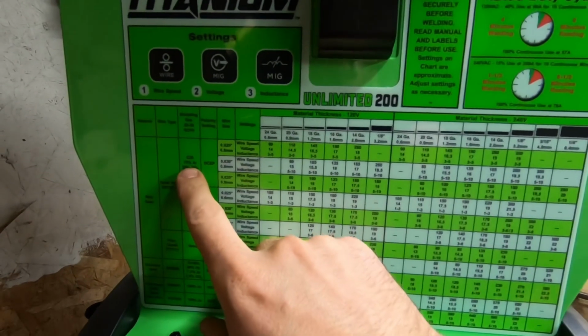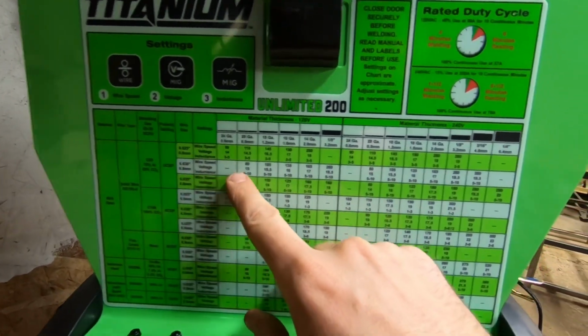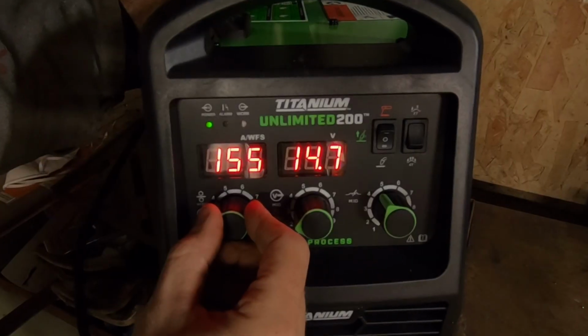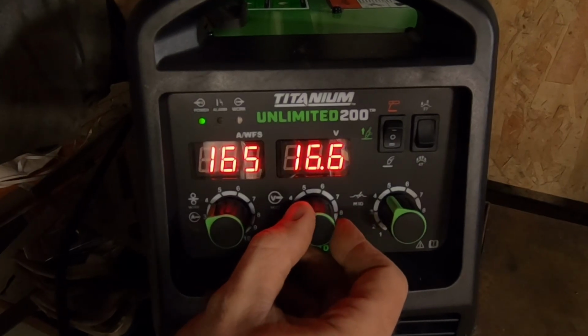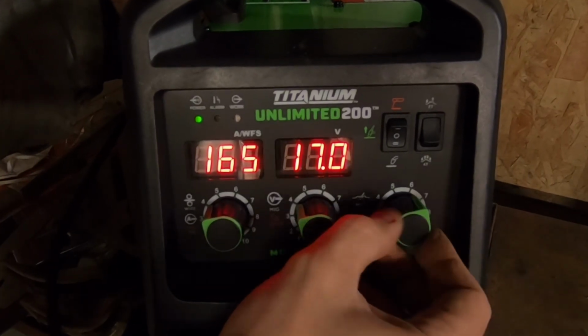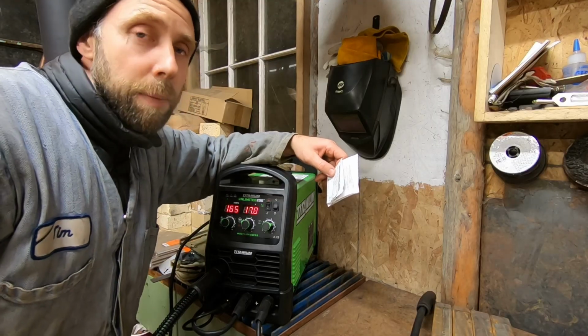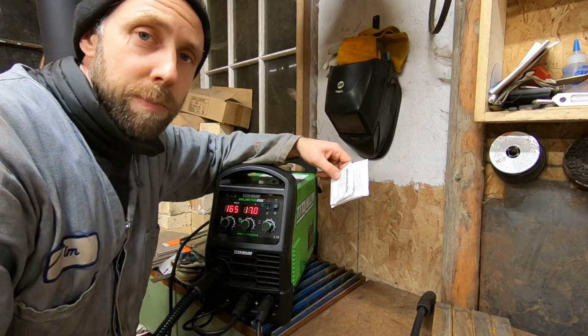So we're running C25 gas here, and we're running .030 wire, and we're running about 14 gauge metal. So it looks like a wire speed of 165, 17 for voltage, and inductance is 5 to 10. One thing I'd like to note is, as you guys know, I got the Vulcan. I bought that with my cash about a year ago. I went and bought this today, and no way am I sponsored by Harbor Freight.